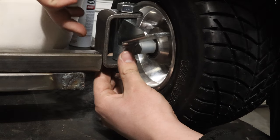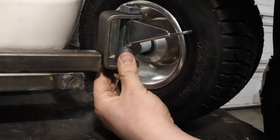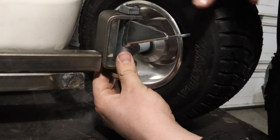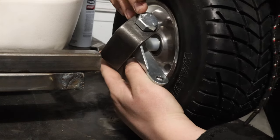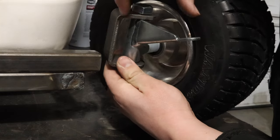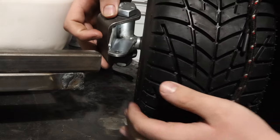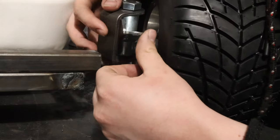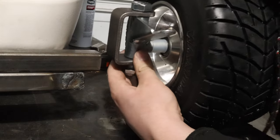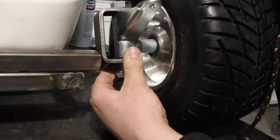It's still not even enough room to weld. I was trying to make it so that right before the tire hits the cooler, the steering would actually bottom out. Meaning that on the other spindle setup, when this tire came up and almost whacked the plastic, this little spindle would bottom out against this so that I wouldn't have to put in a stop. What I'm going to do when I weld these on is actually tilt them back a little bit — that's going to give you better steering.